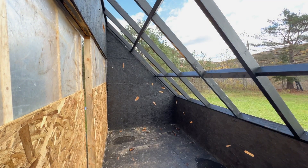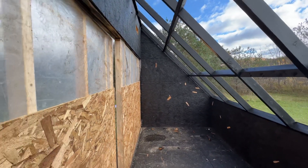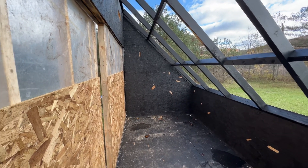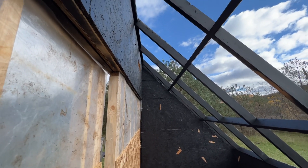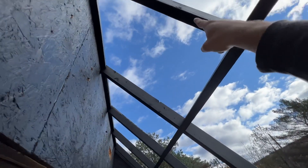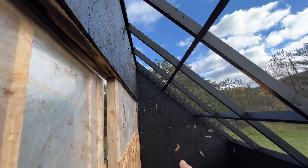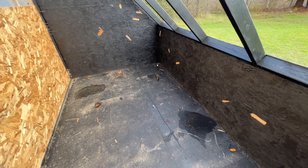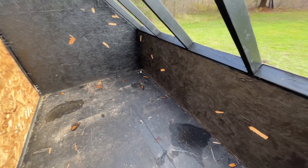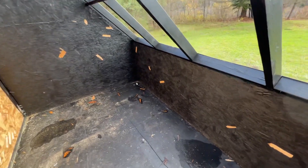I am about five-six and as you can see there's not a lot of headroom, but it's not meant for standing — it's meant to stack lumber. We still need to add the baffle; it will go about right to here, come at an angle to about here. The tarp comes down and drapes over the wood, creating a funnel for all the hot air generated from the roof, kind of like a greenhouse, pushing that hot air down and through the piles of wood.